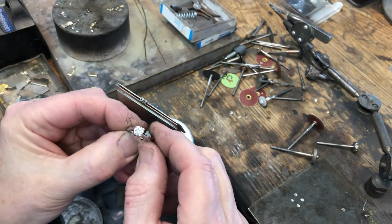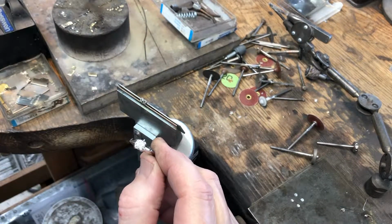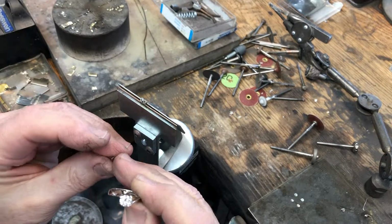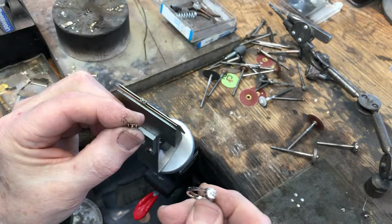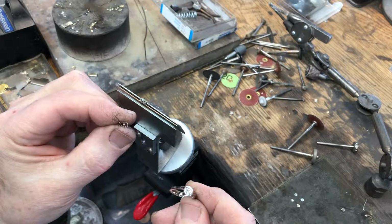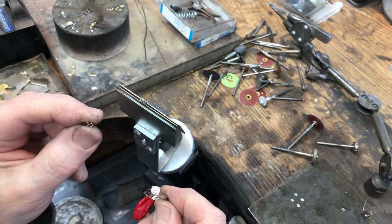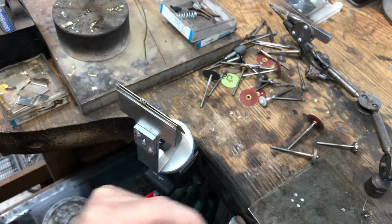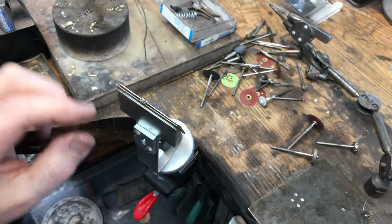I have a diamond ring. The customer wants to add 2 stones per side. I have already taken one 2.8 millimeter setting and one 1.7 millimeter setting because it's tapering. So I've done one. As you can see, I have in the clamp, I have two more.